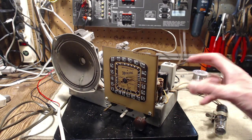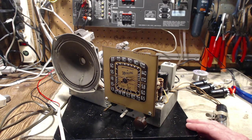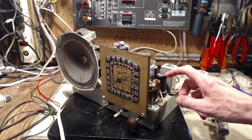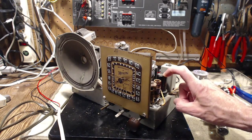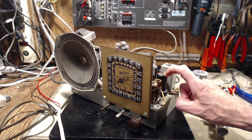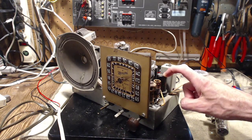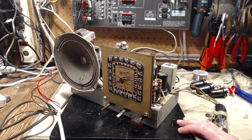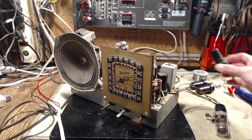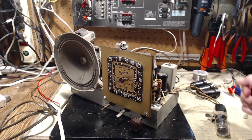Well, that's a huge difference between 1.5 megahertz and 18 megahertz. That's a huge difference from an electronic point of view. So it could be that this tube is working just fine at the lower local oscillator frequency on the AM band, but when you go to try this on the shortwave band, perhaps the local oscillator is very weak at that point. So switching the tube with another tube, I managed to find three potential replacements, may bring the radio right back to life.